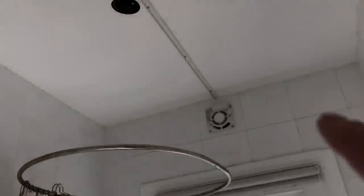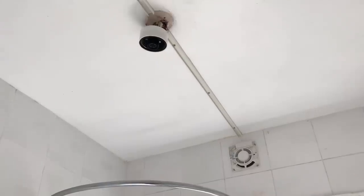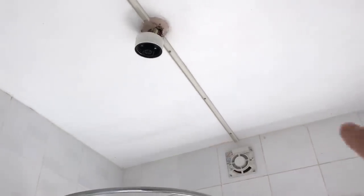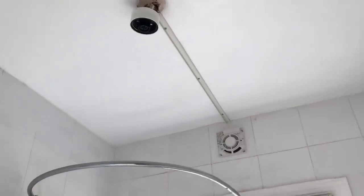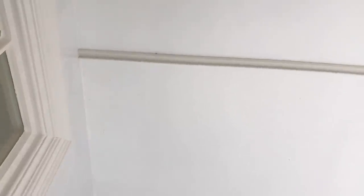Just a little tip when you're putting your mini trunking up — if you just stick it on the ceiling and hope it's going to stay, it won't. Two weeks' time this is going to fall off when it gets hot, cold, hot, cold. Pump a few screws in it — one in the middle, two either end — and that won't fall off the ceiling. I'm also going to either silicon the edges down or paint-mate them — not decided yet.